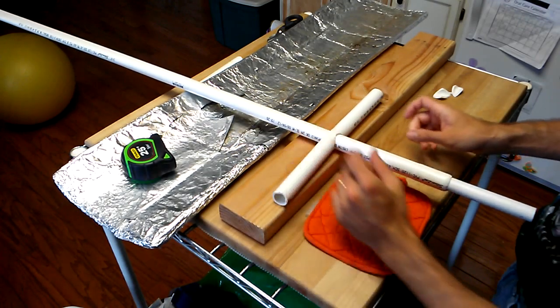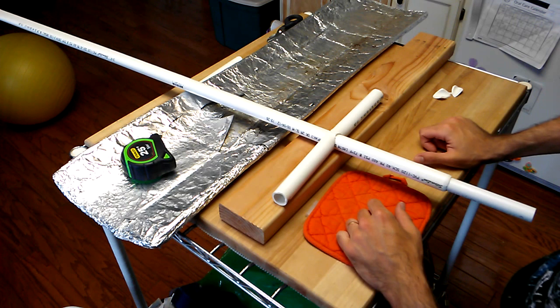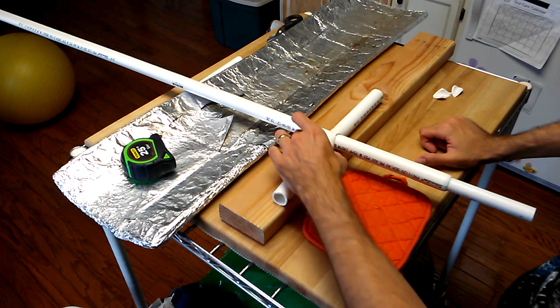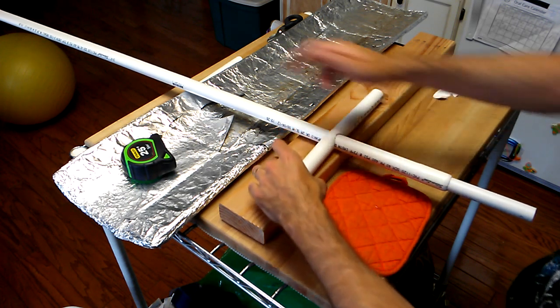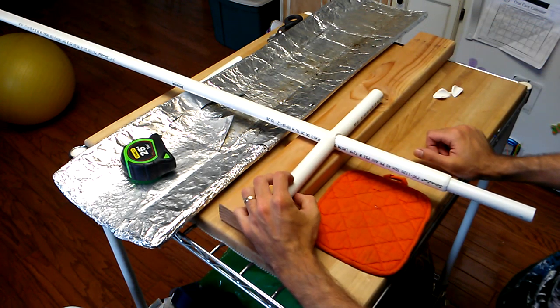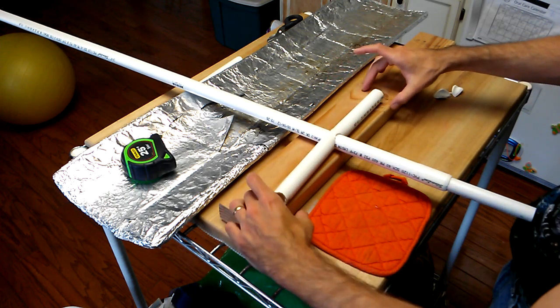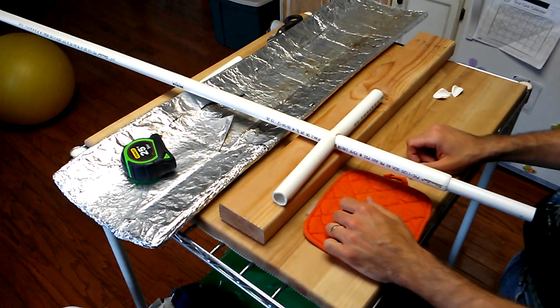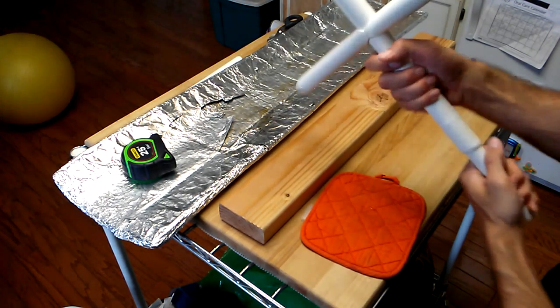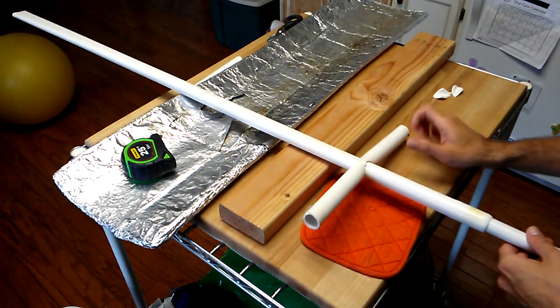Now all I need to do, there's going to be a compound flattening here. First I'm going to flatten these things top to bottom, then the last inch or so, I'm going to flatten the other way. So it's going to be up and down. So it'll be thin, thin, thin, thin, fat. You could leave it like this. It looks fine even like it is. This still is a great sword, and you could very well pass it off as Anduril.